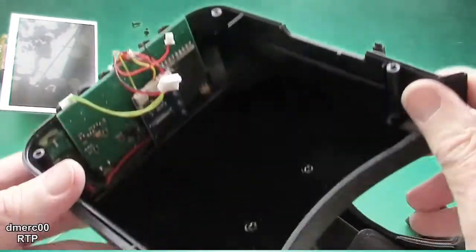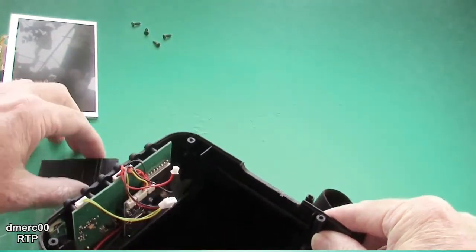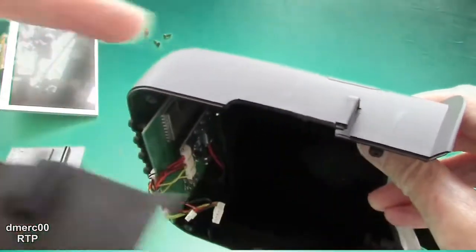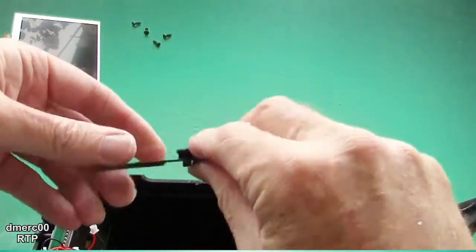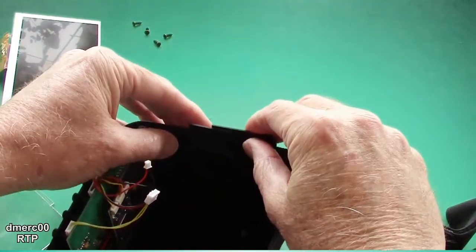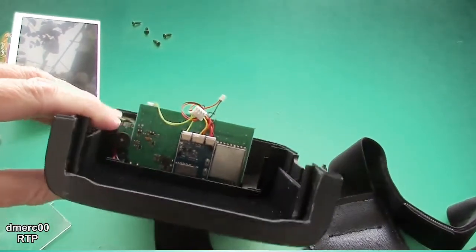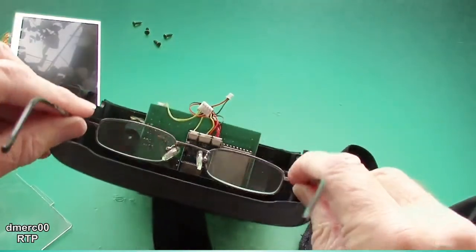Now let's take a look at what I did because I'm farsighted. I just couldn't move these sliders far enough forward to accommodate my eyes. So what I did was take a hacksaw and cut these slots a little longer, both on the top and bottom — both sides so they're a little longer. Then I trimmed one side of the slider panels so they could move further forward. But that left a big gap where there was light coming in, so I glued on a little piece of plastic right here to cover up that hole. I also trimmed out the tabs right here on both top and bottom, so that if I needed to use magnifiers, they actually fit in there now.